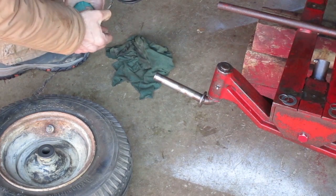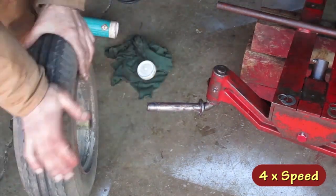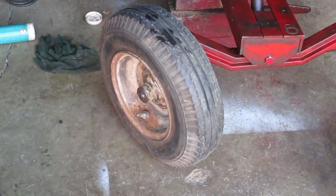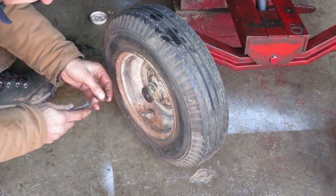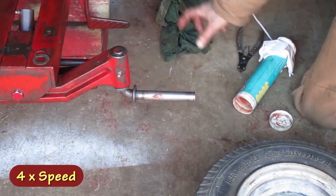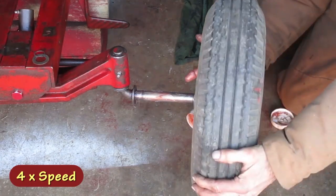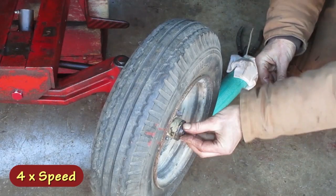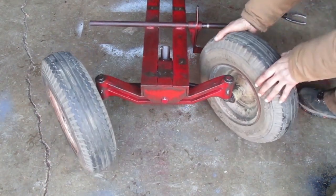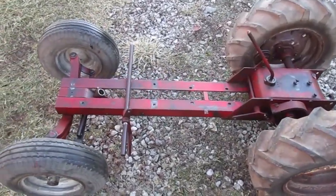More grease to put the wheels on. Make sure you have at least one washer under the snap ring or else a couple of bad things could happen. That looks good — it all moves around like it should. Well, that's good enough to move it around easy.